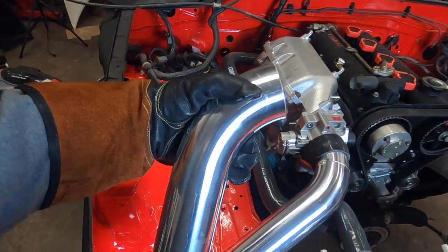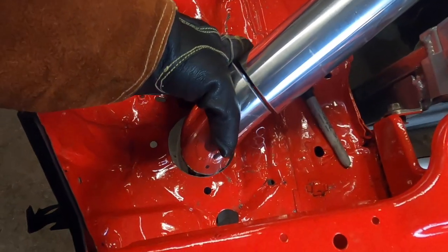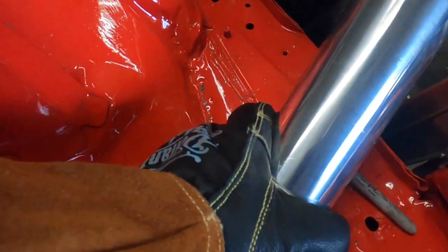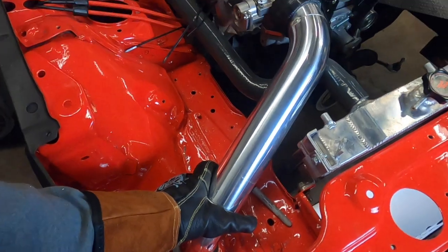This pipe is cut to about 62–63 degrees. This is 2.5 inch and that's a 3-inch hole saw, so there's room to play — about a quarter inch all the way around. The pipe comes straight down and everything is lined up. That gap, which you can barely see right there, is good. So I'm going to mark this and tack it up.